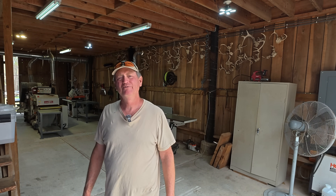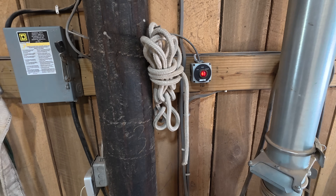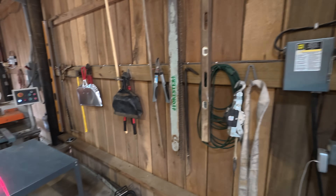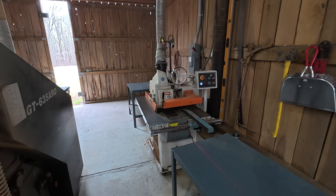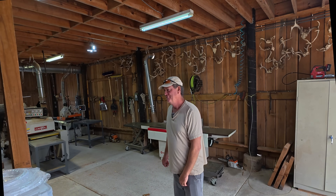Here's how it works: as soon as I throw this switch, the phase converter cranks on and I now have three phase power. Three grand and you can have 30 horsepower of combined three phase to run every machine in your shop simultaneously. That ain't hard.